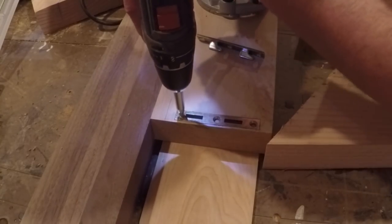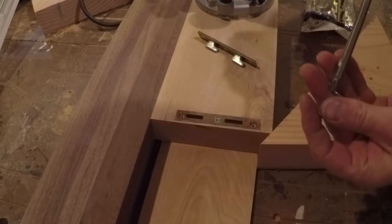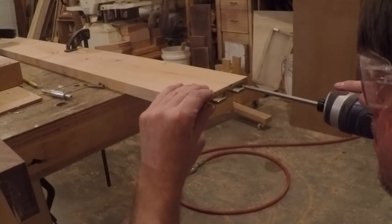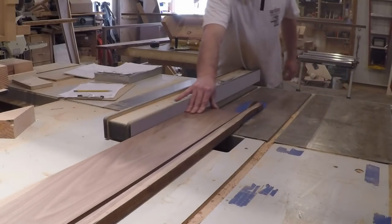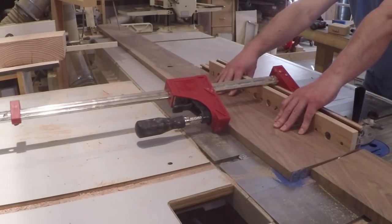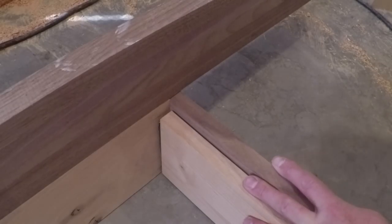To attach them it was easy enough — just pre-drilled some holes and screwed them down. Then it was the same operation for attaching the mating pieces to the skirt board. Now I'm on to building the walnut skirt boards, ripping the width and milling to thickness, cutting them to length using the same clamping methods as before. I wanted to be sure I couldn't see the end grain of the alder on the headboard, so I notched the side skirt board so it would hide the end grain when installed.